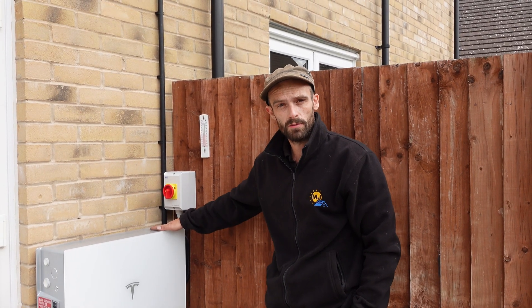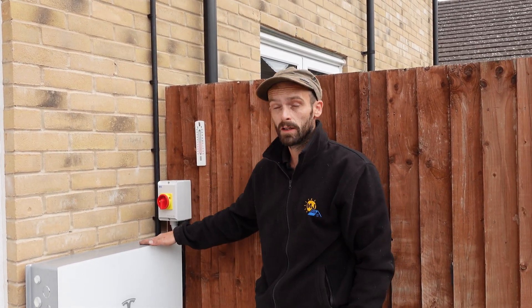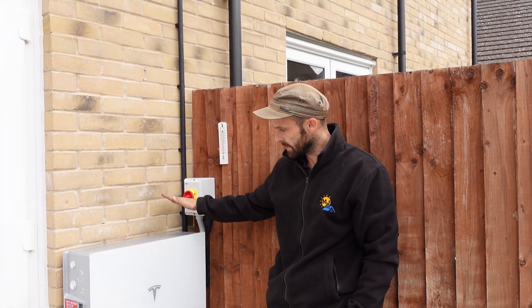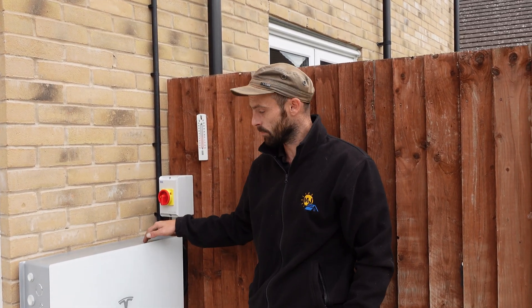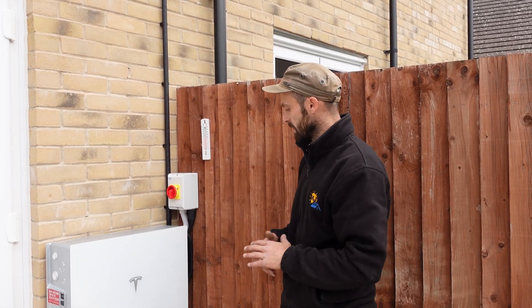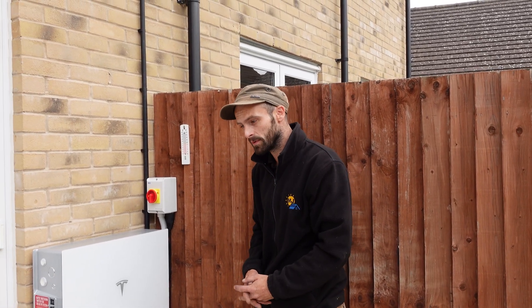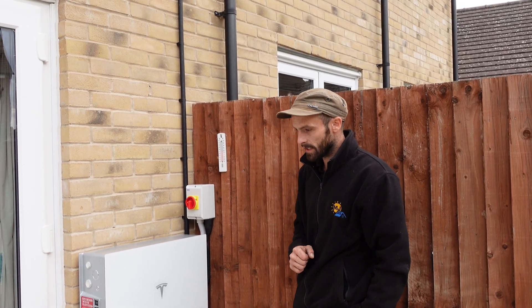We're all finished now for today — just a few stickers to install and a bit of tidying up, but the main installation is done and complete. We've got six solar panels on the front and five on the rear with bird protection. This is a brand new Tesla Powerwall 3 with a 13.5 kilowatt-hour battery and a 10.5 kilowatt inverter all built into one unit — an extremely neat, compact unit. We'll also get a picture of the gateway installed inside. It looks fantastic, the customer is happy, and we're just finishing the final setup on the customer's phone, stickers, and tidying up — and that is a job done.